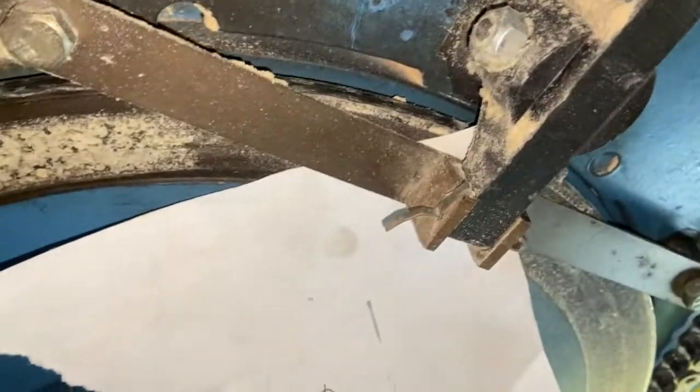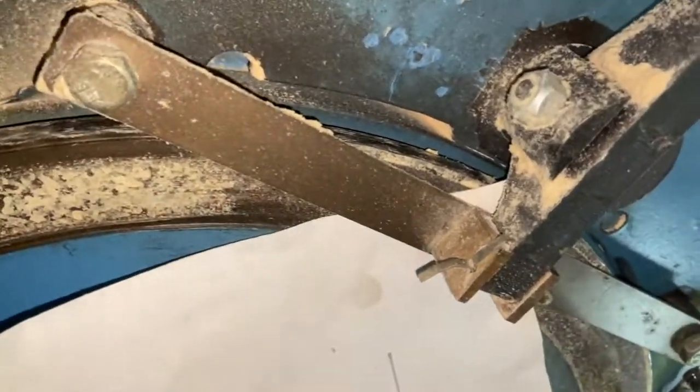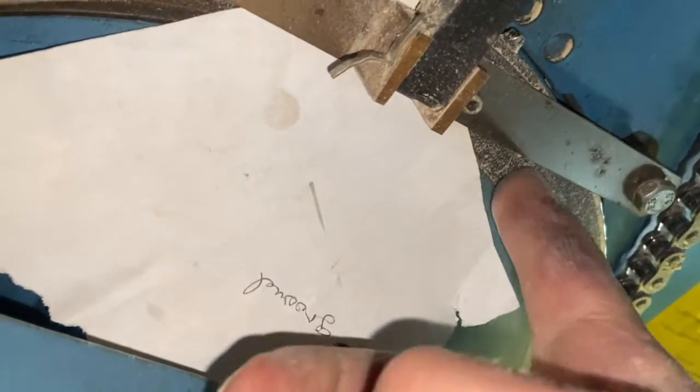If you're feeling some drag on the paper when you're in there, that's good. You just need a little bit of an air gap when the brake is released. If there's too much air gap the brake won't hold. If there's too little air gap you'll start to see scraping happening on the brake disc.